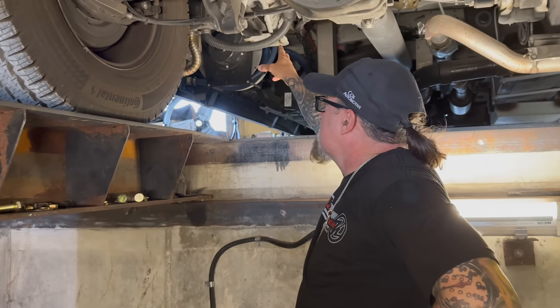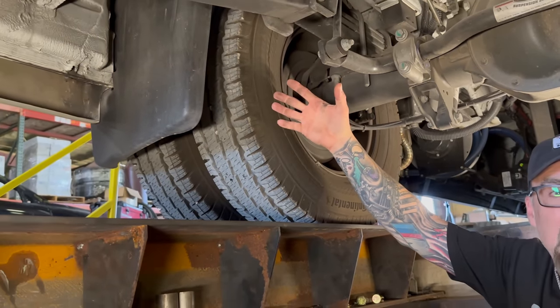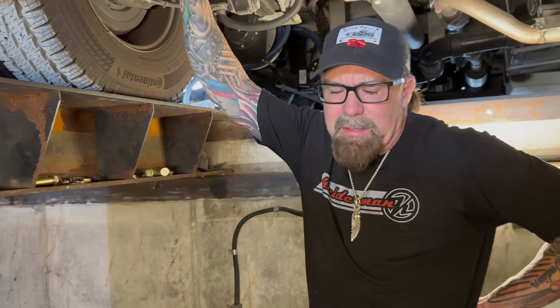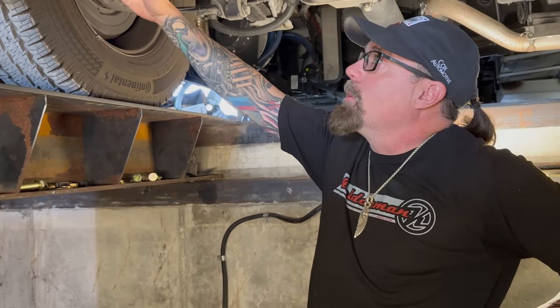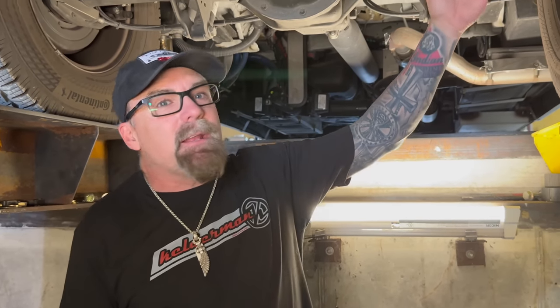Grech used to use the VB. The VB air, uh-huh. So what's the difference between that and what? Well, the VB removes the leaf springs, and they're on a big thick leaf spring, and it comes out, put an airbag on the side. Okay, so you got one on each side. And I don't know if I think they still use a sway bar. I mean, they have to. Sometimes on a semi, they don't use sway bars because they run massive, thick leaf springs. For those heavier loads, you have a little more flexibility. But I know that this type of system's on lighter vehicles like this.